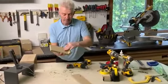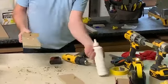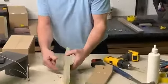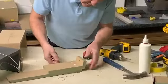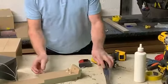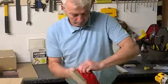Steam at the back also, okay? Now, you just need to put a small drop of glue into each of the holes. Okay. And get your hammer. Now, put it on top of that there if you want, because you're going to put pressure on that there, so better off keep it up there on a level surface like that. As you can see, and just tap in your dowel. Now get your damp cloth and clean off the excess glue. Okay? That's fine there, so.